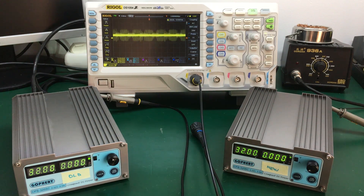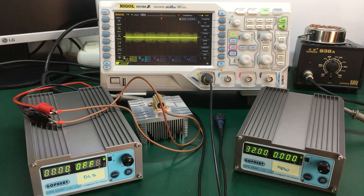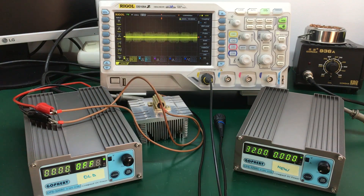For maximum output voltage at 32 volts, no load: the older revision has a noise of 54 millivolts peak-to-peak, and the newer revision 56 millivolts peak-to-peak. Now we're also going to measure the output noise with a load connected. I have a 4.7 ohm resistor that I'm going to switch between the two power supplies, with the output set to 5 volts.